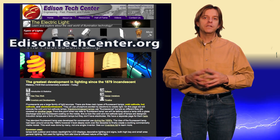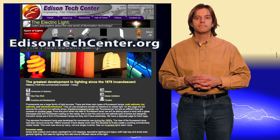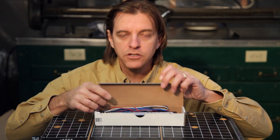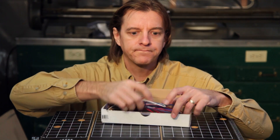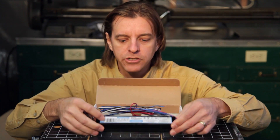So that's a summary of the theory of operation on fluorescent lamps. A great resource online that has a lot more detail can be found at Edison Tech Center, and I'll leave a link in the description below. Since fluorescent lights are so simple, about the only thing that could cause this kind of constant failure is a bad ballast. So that's what I'm going to replace in this fixture. This is a new ballast I picked up at the big box store down the street, and this is an electronic version to replace the magnetic version that came original in the lamp.